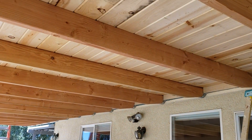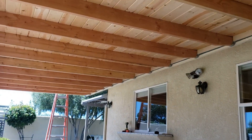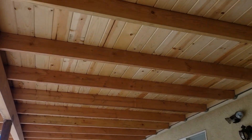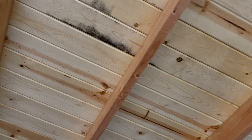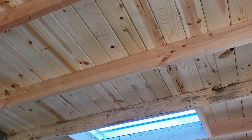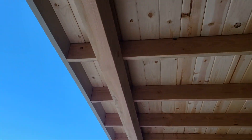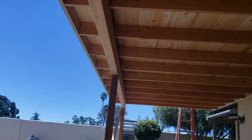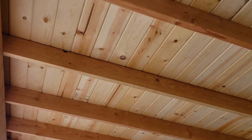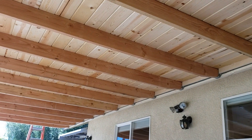Once again, Royce Eddings. Work is progressing on the patio cover in Paso Robles. Previously there were only two by four rafters — half were covered with aluminum awning type siding, typical of a mobile home, and the other half were covered with just some lattice panels. All the beams out here were dry rotted and collapsing, so we replaced all the posts and beams, put two by six rafters in and two by six tongue and groove. We're up on the roof right now doing the roofing.